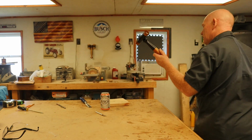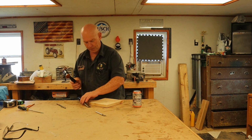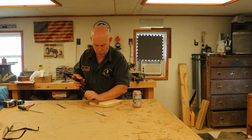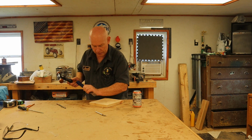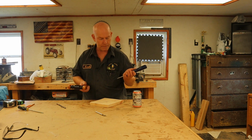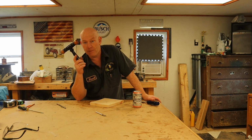The whole intention of it was just to have a little tiny lightweight hammer to where if you're trying to just pare off just a little bit of wood, you don't want to take too much and just shoving on it isn't working. You just want a real fine detail. So if you're trying to refine the shape of a dovetail or something, that's what I was making this for. So pretty much it'll never get used because I've never actually even made a dovetail.